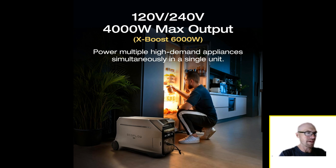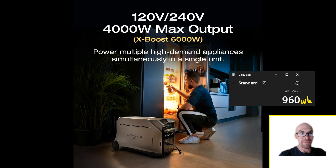Say you want to run your full-size refrigerator, which uses about 1 to 1.5 kilowatt hours per day. You're looking at this thing thinking it's got 4 kilowatt hours — but you forgot to factor in the inverter. If it's using 40 watts, that's 40 watt-hours every hour. Over a 24-hour period, that's almost 1 kilowatt hour — just the inverter — and you're not really accomplishing anything.